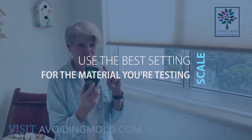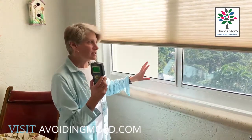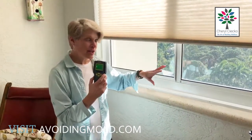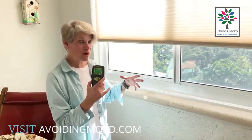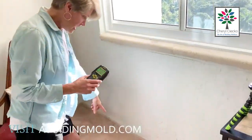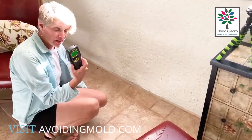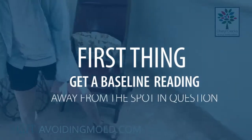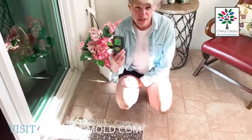At the end of that webinar you'll get a discount for some really good moisture meters. So what we're going to do here — I am in a high rise, and there's a ledge outside this window that I can see. I'll have some pictures to show you of where water is ponding. I was curious whether water that's been ponding can actually get into the building and cause problems, and I think it is. So I came in here with this moisture meter. This is tile and concrete because we're in a high rise. I'm going to use the masonry setting. First I find somewhere far away to get the baseline — what I found was the baseline is in the 30s: 33, 34, could be as high as 37.